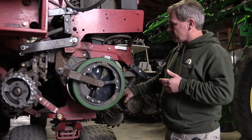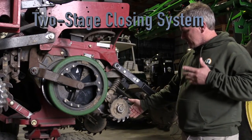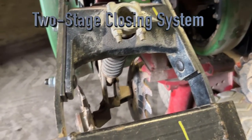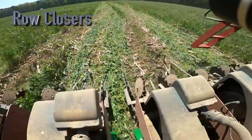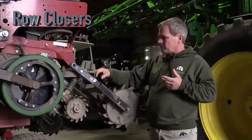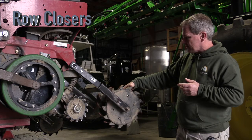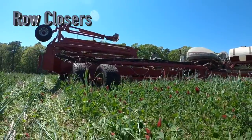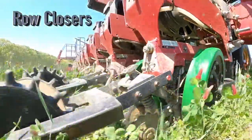On the back we're putting fertilizer in the furrow — it runs off the tank into the trench. This is the standard case setup, but normally they have a round disc blade here and we've changed that to spike teeth. We found they're sturdier, plus they work the ground a little bit. Normally there would just be a flat four-by-four tire in the back, but we weren't getting good trench closure. So we made a custom bracket and put on two closing wheels — the trench cuts all the living roots, then these close it up.